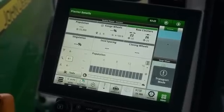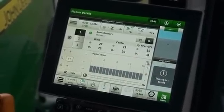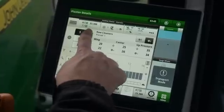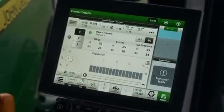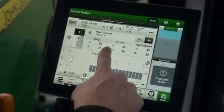On the display, press on the row cleaners tab to open the pneumatic row cleaners module. There are four parts to the module. Here we have the buttons to raise and lower the row cleaners. Next, we have the system status. There are three factory presets to the left and the pressure status and control panel in the middle.